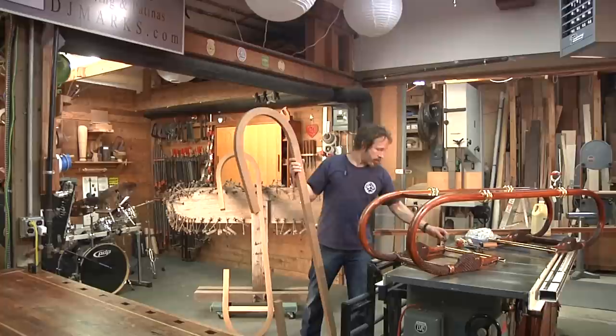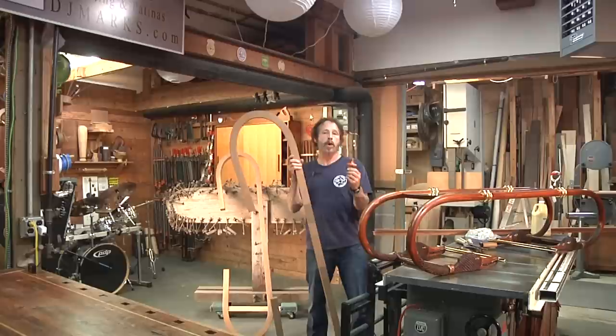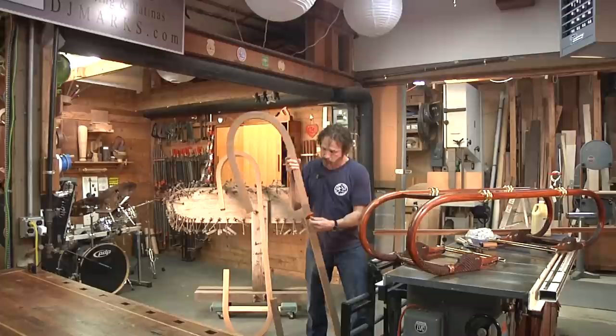And once the joinery was cut, then the next thing I wanted to do was to take this shape and round all those corners and get this sculpted shape that you see here. So the quickest way to do that was just with a very large roundover bit. So I used a large radius bit to step it around all four sides and use that to do the rough shaping. And then I came back and finished it off with some handwork.